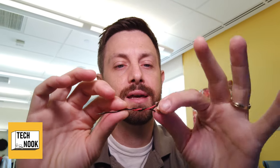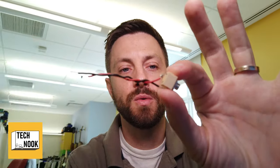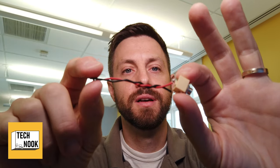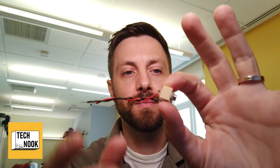3.5 millimeter headphone jack. You will solder two wires, keeping them different colors so you can see them. In the end, it doesn't matter in this case. One for positive, one for negative, because the headphone jack is what switches get plugged into. Any of those Big Mac switches, any of your other enabling devices use just plain old switches with a headphone jack on the other side. So simple.